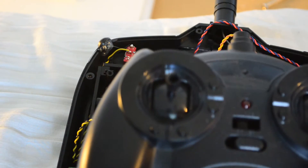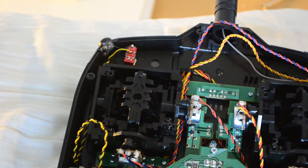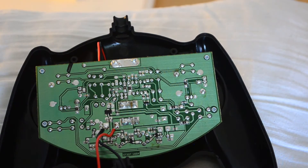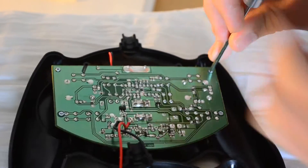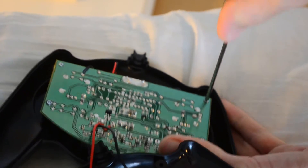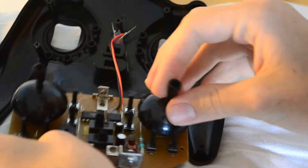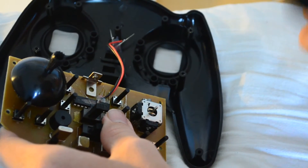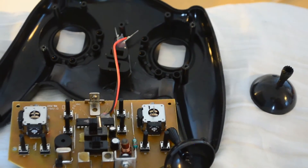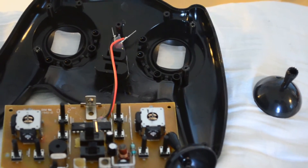Most gimbals are very tight when you get them from the factory, and so that's why it's a good idea to go ahead and adjust to your preference, because it will make your flying experience much better. Now I'm going to go ahead and show you what this guy's gimbals look like, just as an interesting comparison to what we've seen in the DX6i and the DX5e. We're going to put this aside and bring the other one onto the bench. When we open up this transmitter, we can see it's an extremely different layout from what we saw in the DX5e. There's a main circuit board right here, so I have to go and take out the screws — they're very rough — and then we'll look at the gimbals. These gimbals are extremely different from what we saw in the DX5e and the DX6i.